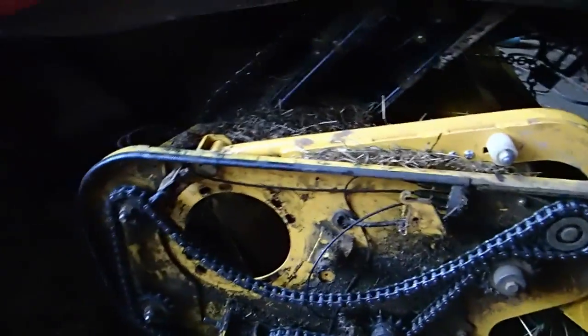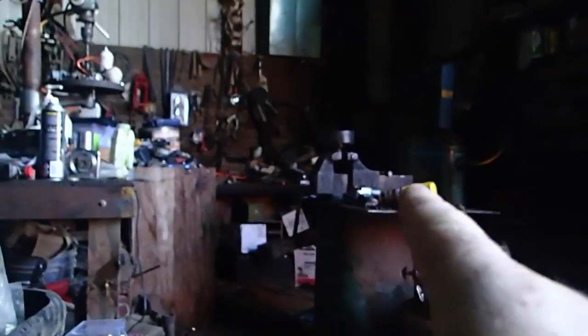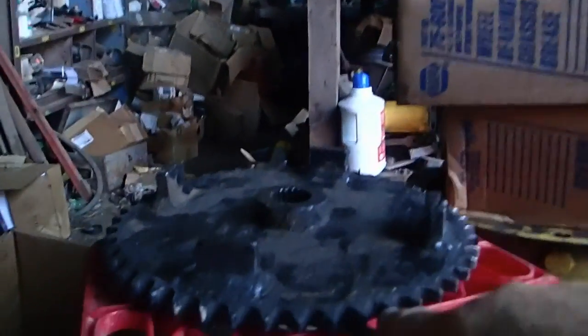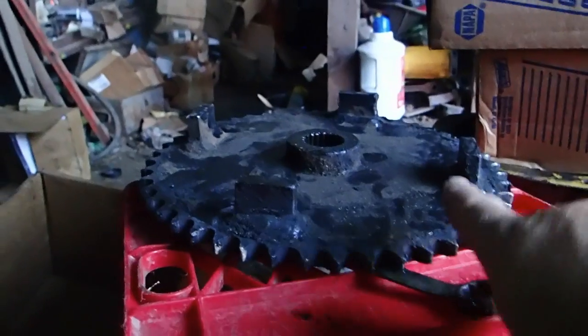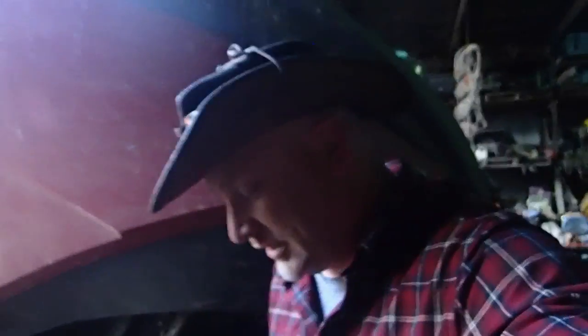And what happened was, when he opened the door, it allowed that chain to fall down and catch these lugs. You can see them, they stick up about 1.5 or 2 inches. It allowed that chain to catch those lugs and jam things up. That slip clutch would have slipped had the chain been on here. It would have slipped. But because the chain actually grabbed these two lugs and wrapped, it put a side torque onto it and twisted off this wonderful shaft right there. Twisted that right off. Well, the effed up thing is, I twisted that shaft off 2 weeks ago when I broke the header.